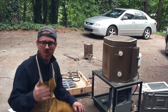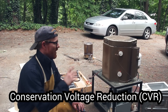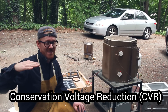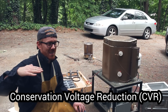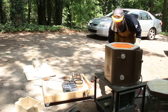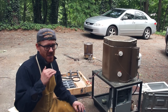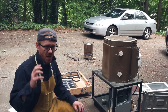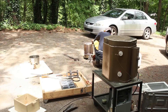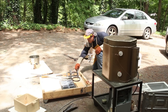Probably because it's getting to be summer, the voltage on the system is lower — it's not 120 volts, it's 116 volts. That means my kiln is kind of flatlined; it's not getting any hotter. It's at about 1,960 to 1,980 degrees. I think there's molten copper in there, but it doesn't look like it's going to get any hotter.